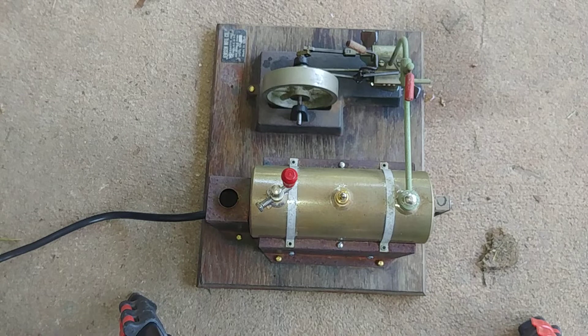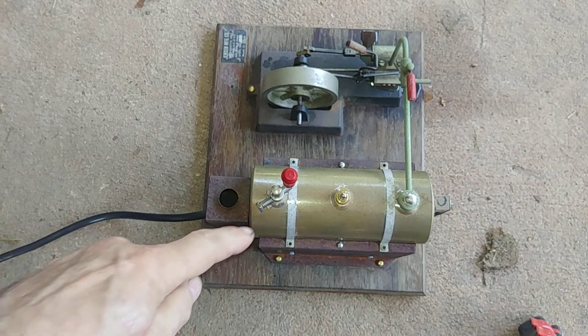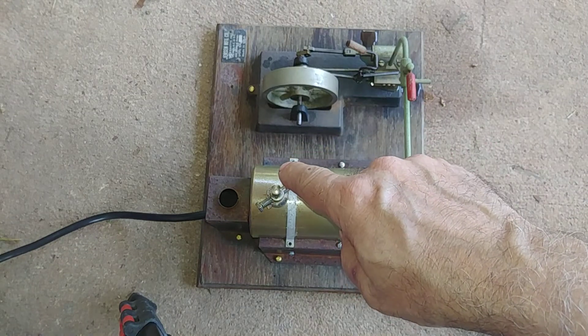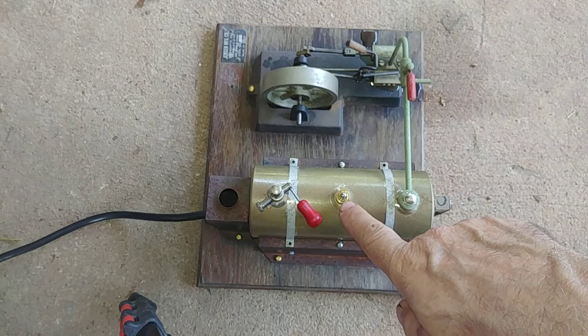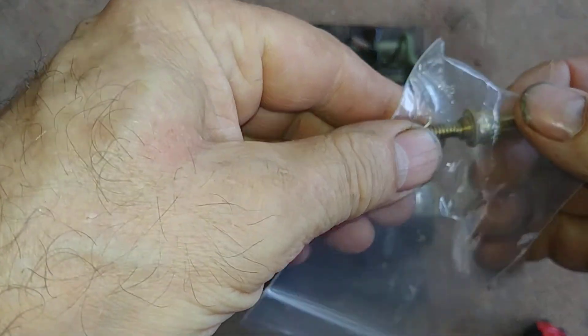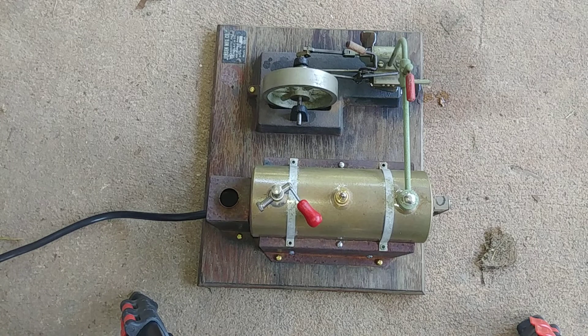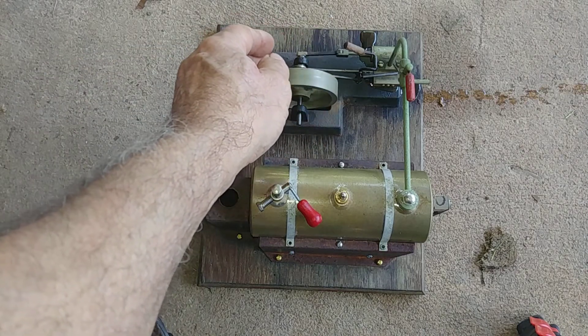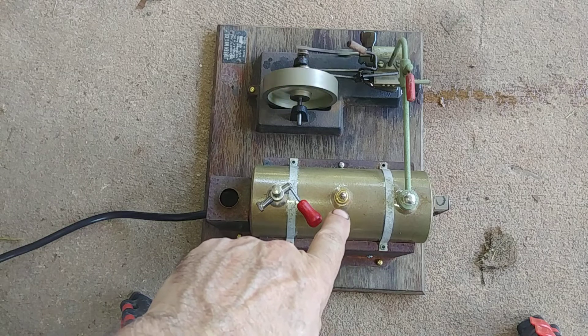So this thing is starting to heat up. I've got steam flowing through the valve here from the boiler, and the whistle is starting to operate. Let me shut that and start building up pressure. This will start to bubble. Here's a picture — this is what's inside, and this is the part that's inside the boiler. There's a little spring that releases the excess pressure; I think this thing only runs at a couple of pounds. You can see the pressure relief valve working.